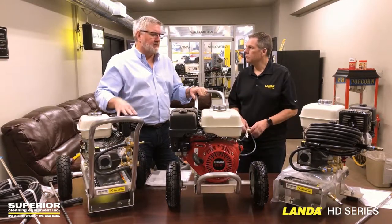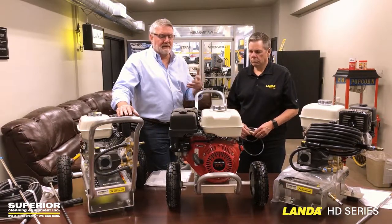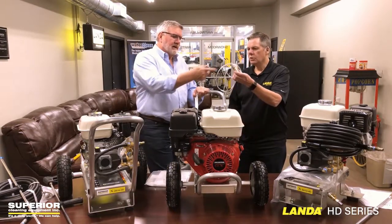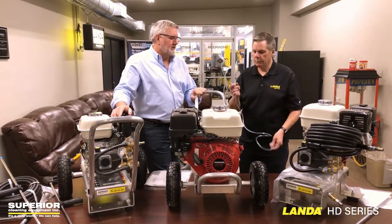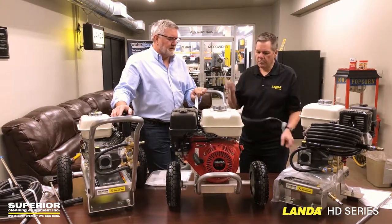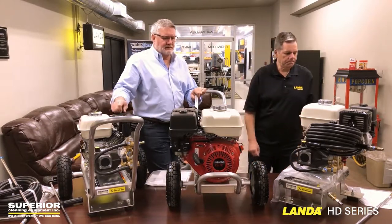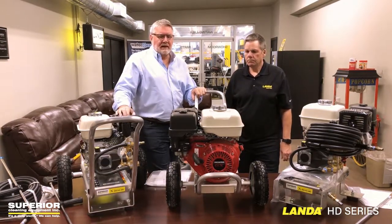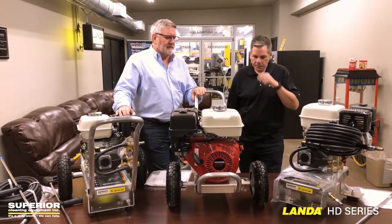A lot of times, if you're in Maricopa County or San Diego County area, we'll deliver it for you. And if you come pick it up or we deliver it, we'll train you on it — because there are a few little things to go over, like not doing certain things with the trigger gun. A downstream injector comes standard with the unit. So if you want to wash your house, wash your car, whatever, you use the soap injector downstream. There's a separate video on downstream soap injection on the YouTube channel. One of the nice things about downstream is the soap does not run through the pump and unloader, where it can cake up and bake up in there.